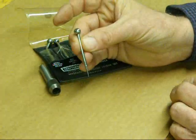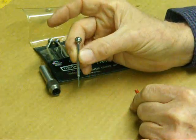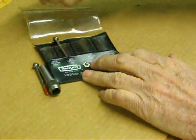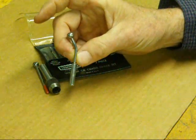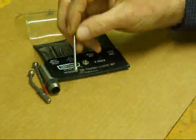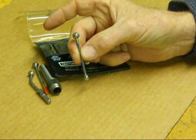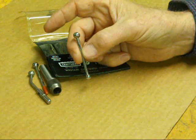One is just a needle point that will assist you in locating a center punch mark or a scribe layout mark. And then there's a little indicator holder that would hold a last word indicator or test indicator. And then finally there's the edge finder here. I'll cover all three of those on the milling machine here presently.